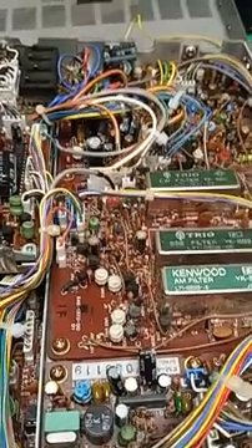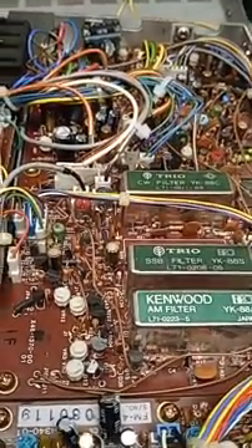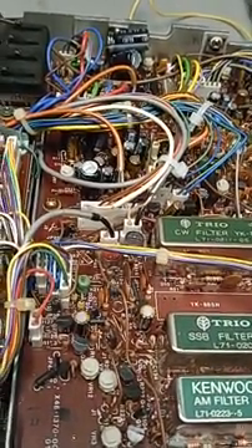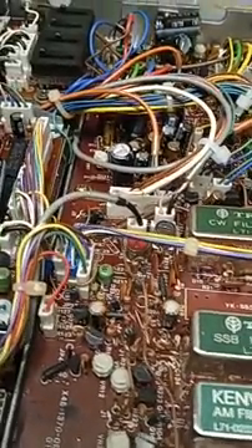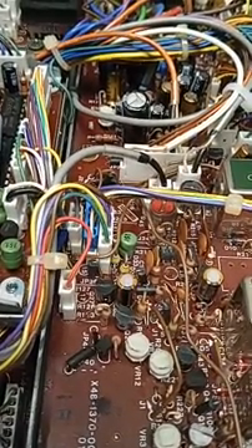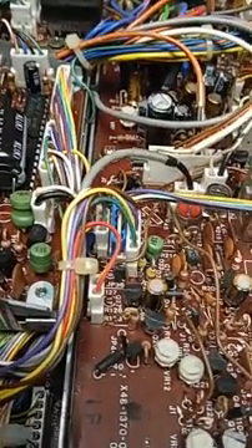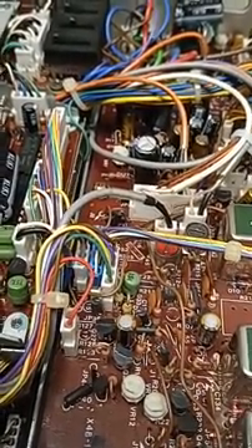The procedure to recap a unit like this — especially with our modern phones — is to take numerous pictures of where each connector goes. They're generally color-coded and marked on the board, but not always on the connector. These connectors used to be softer plastic but have hardened with age, making the locking tabs stiffer and more difficult to release. Pull straight up — do not pull on the wires.